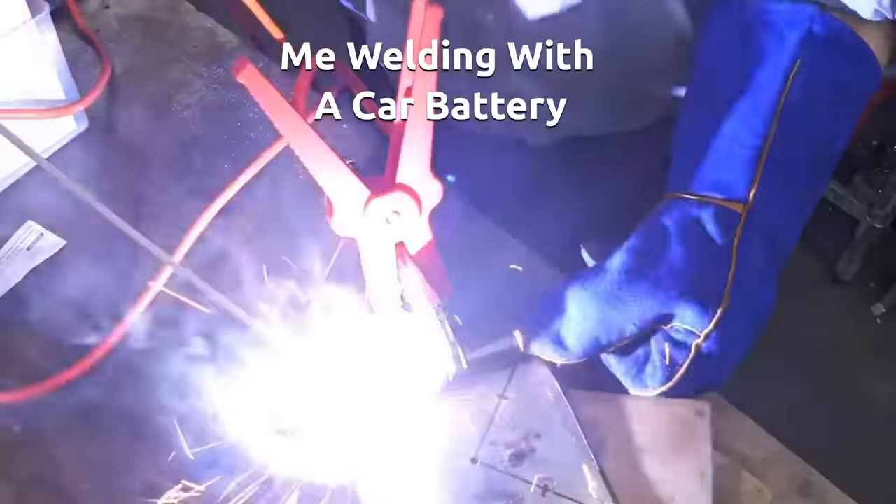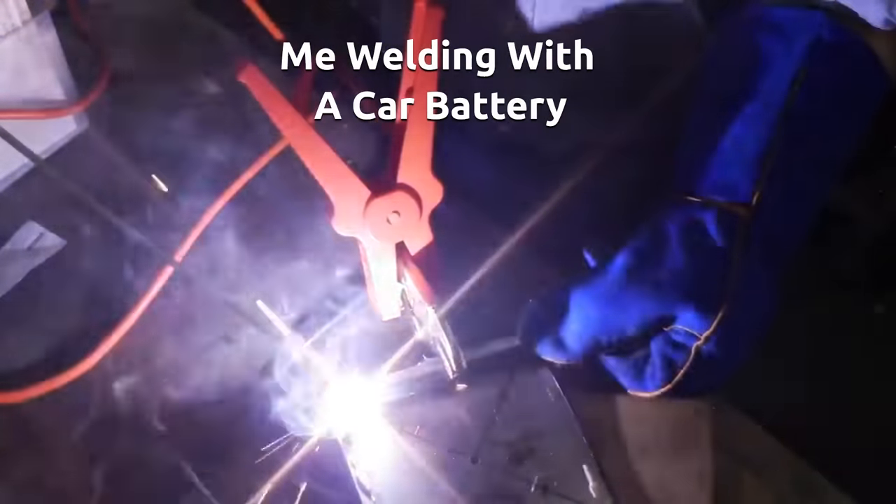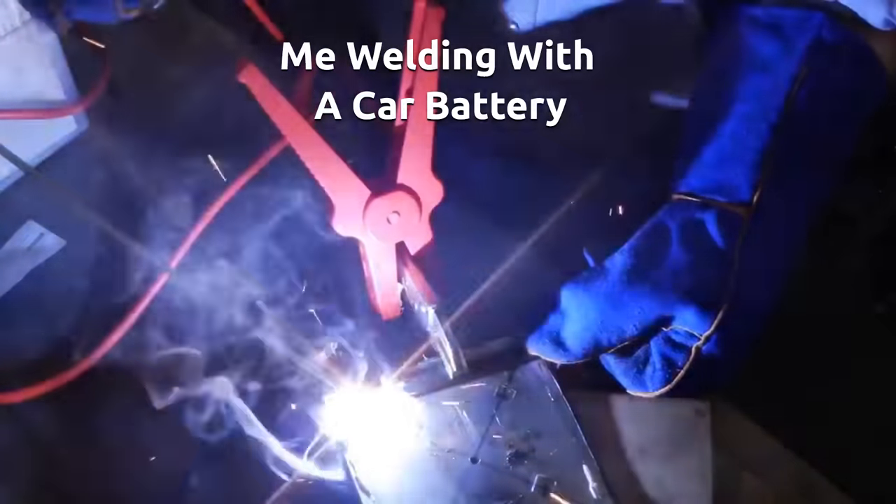Something else happens when you start adding DC volts in series, and you can see this with batteries. If you take a 1.5V battery and put another on top, you get 3V — and the same thing happens with solar panels. Your average solar panel produces something like 50 volts; two together on a string is 100 volts, and twelve of them is 600 volts. That's a pretty lethal voltage. If you've got a 600V system and a wire chafing, it's a very serious fire hazard, and of course 600 volts is also a danger of death — and this has led to legislation in many countries requiring safety procedures including fast shutdown.